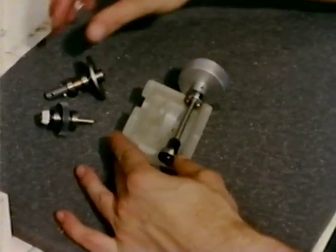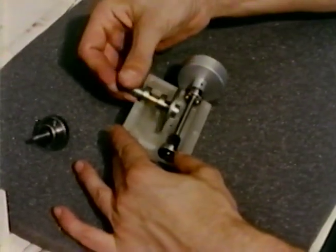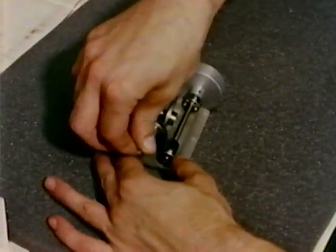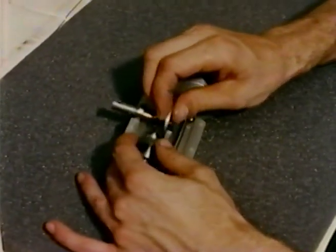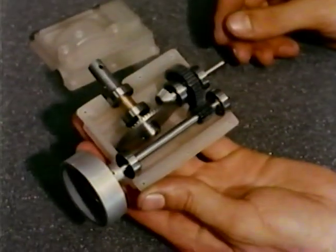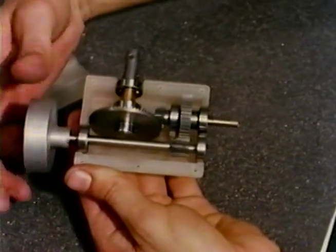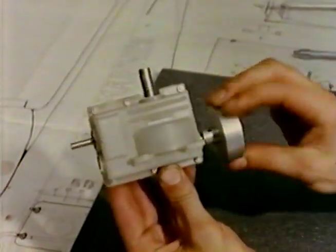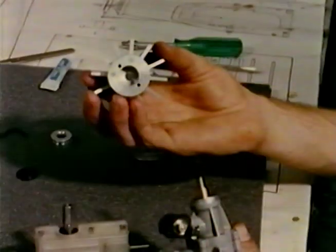Perhaps of greatest interest is the mystery which surrounds the method of gear reduction and power transmission. This is accomplished with an assembly made up of three preformed cogwheels and shafts, all in high-precision ball bearings. The unit is specially formed for maximum efficiency and minimum power loss. It's self-enclosed and runs service-free in its own oil reservoir. The housing is transparent, permitting a convenient check of the oil level.